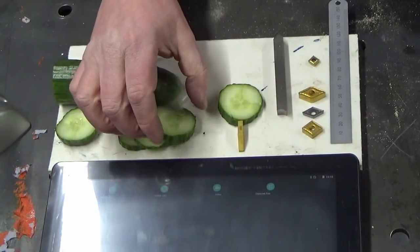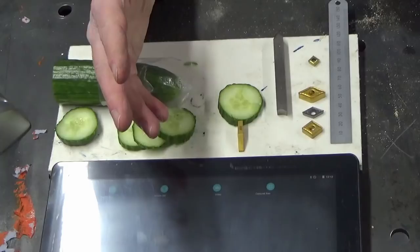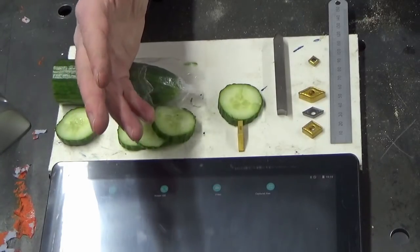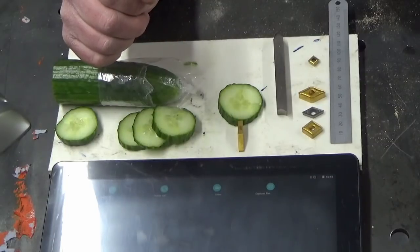And I've seen it many times on hard materials. So if we start talking about nickel alloys now on a CNC machine in aerospace, seen this so many times, it's happened to me so many times, because it's very easy on a CNC machine, you can dial in, you know, 0.5 thou offset, rerun the cut, nothing happens.